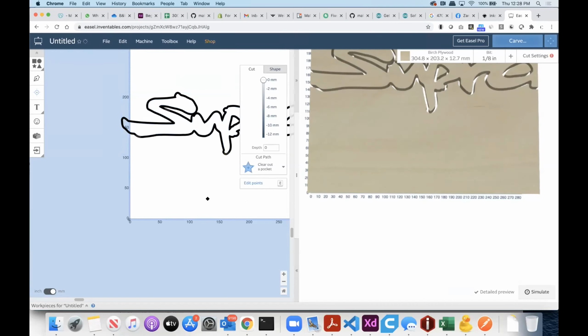Do any of you guys use Fusion 360 for CAD and CAM design with M2? I just downloaded it 3 days ago, so I'm getting ready to. I'm in the same boat, and I've downloaded Blender for 3D sculpting. I haven't tried that yet, but that's a free program. Nice. I think Meshmixer is another good one on the 3D printing side. I use that a lot if I'm slicing up a larger file and I need to segment it, or retouch some surfaces because there are too many polygons, or if you find pinholes.